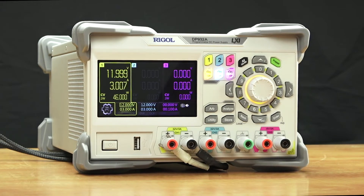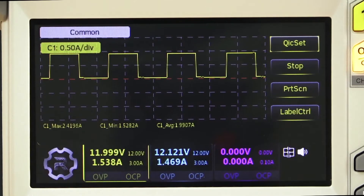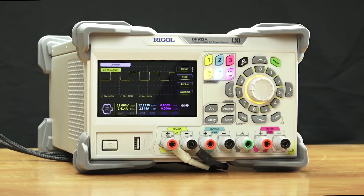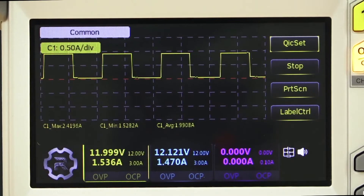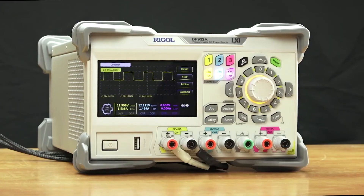We've also made a couple of changes to increase both the speed and accuracy of this instrument. We can go into analysis mode and see the square wave form factor that we're producing in current space. We're actually pulsing between 3 amps and 4.7 amps, changing every few seconds in a pulse formation, in response to the device it's connected to.